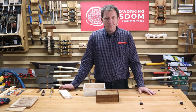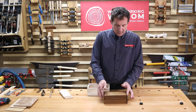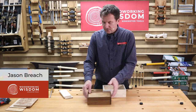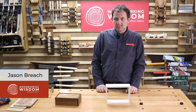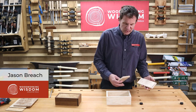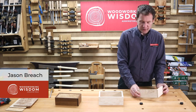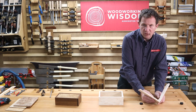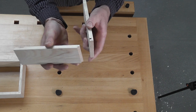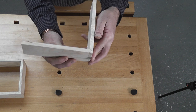Hi, I'm Jason Breach. What we're going to do today is continue our little jewellery box project — the small box we have here, which we did as a write-up and are now doing as a video. Last episode we did the frame. It takes a little bit of time — people always ask how long it takes to make something. That took an hour to run through. We did our routed halving joint, which comes together to make a corner joint. Quite nice to look at. You can see how this comes apart — you get your slot, your tenon, you put the two together. That looks good.